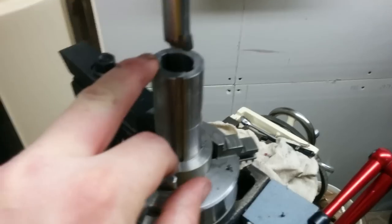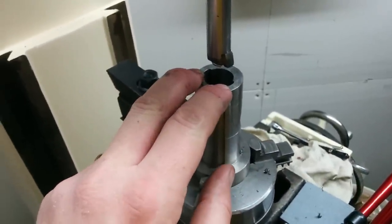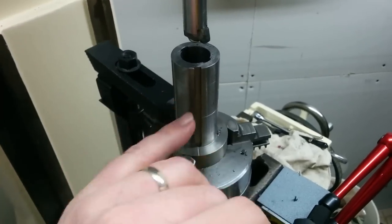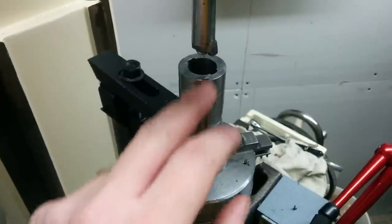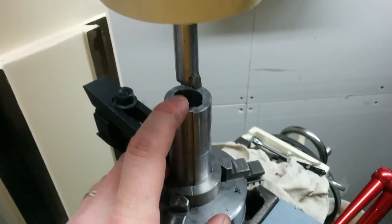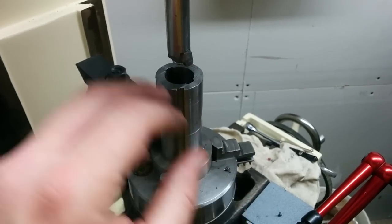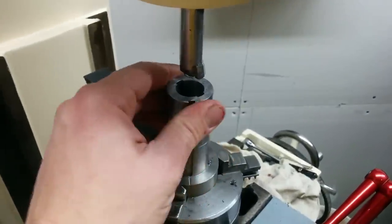News on the spline cutting - I've been a victim of massive deflection. Although the beginning of my cuts are where the dials say they should be, the reality is I'm actually quite short at the mouth. I put a penlight in there and you can see it tapering off pretty bad - it's deflecting on the way down. I need to address my tool, sharpen it right up, get a little more relief on it, and have another go. Thank god for the indexing head so I can get back to where I need to be relatively easily. I need to take this tool out and clean it back up or make it even better, because this just isn't going to cut it. The process is there - I just need to nail down the tooling and I think I'll be alright.